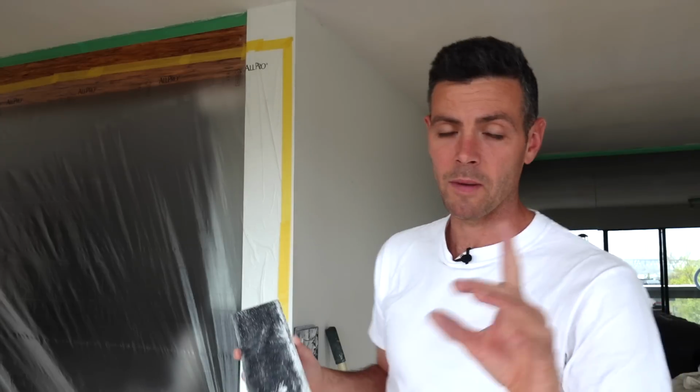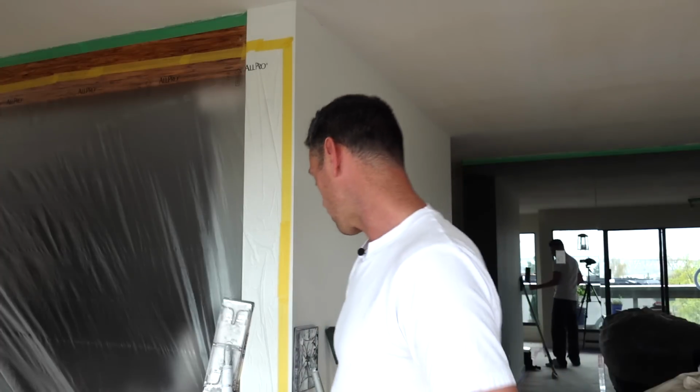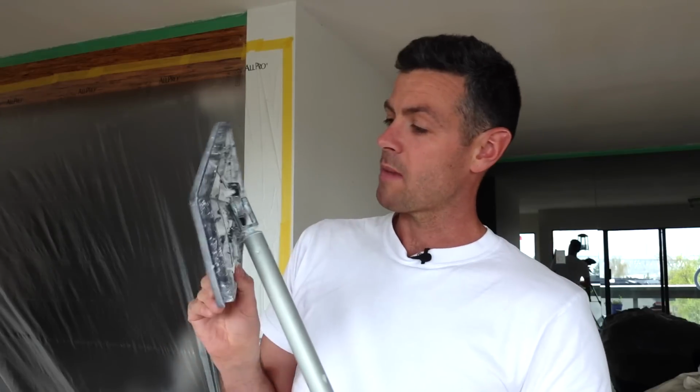But my second coat, my final coat, is almost always dead flat and smooth to the eye, but it actually has a bunch of small lift-offs and also the texture of mud, which needs to be sanded off to be ready to accept paint. So the reason that I think this one is so good is because it's one of the only tools I've ever found that actually does a near perfect dummy-proof job that you can put in just about anybody's hands. So one of the main things it does is it doesn't flip over. That's a nice feature, right? It's so big and broad.